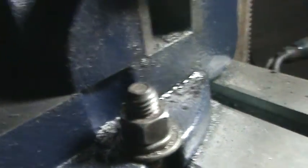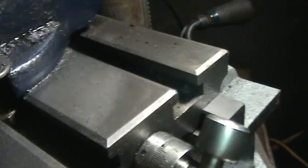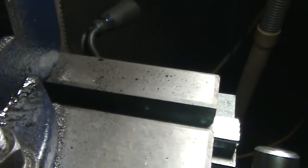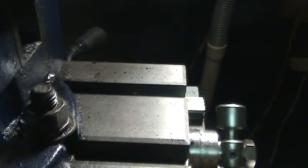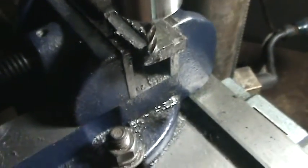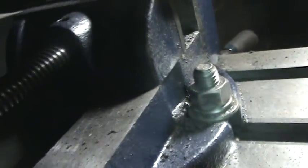You hear that? The part that's not climbing is on the inside, over here, and I'm coming back this way — then it's a conventional cut on that edge. This ain't easy metal. This ain't easy iron to machine. I've been doing a little bit of study on the different types of iron that can be machined and their machinability. This type of iron has very poor machinability.